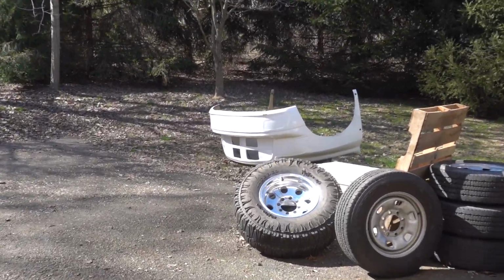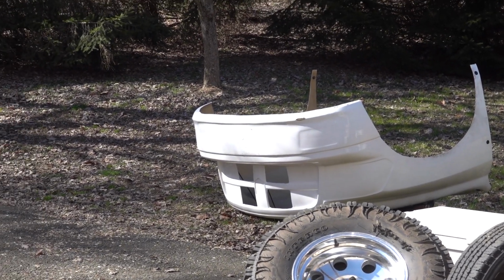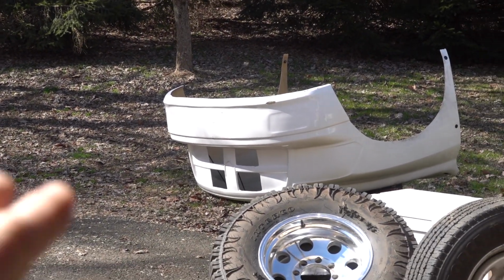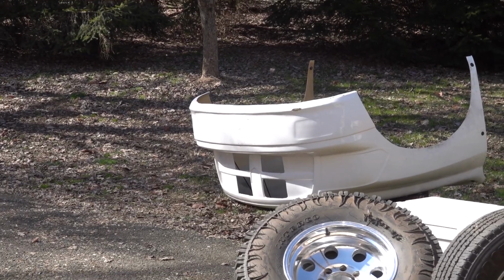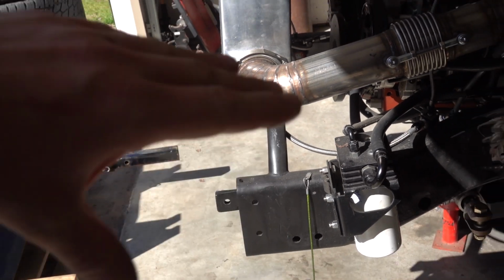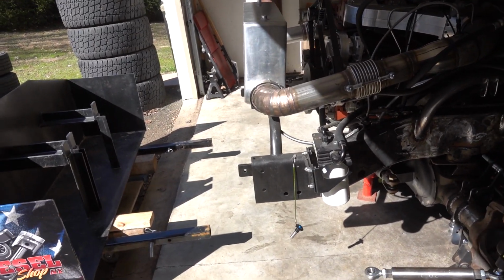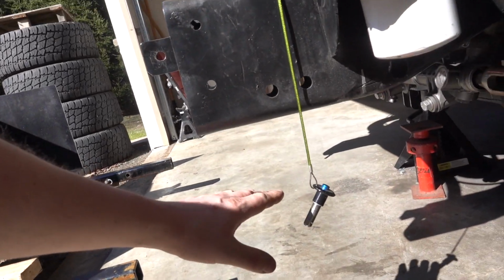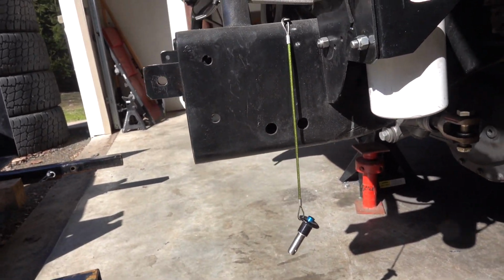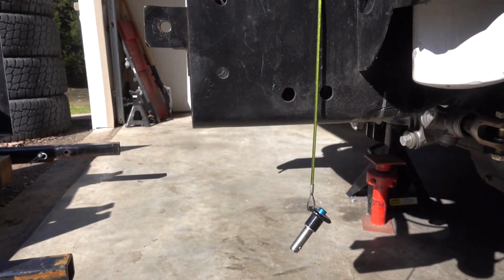Our problem is, obviously, our bumper is attached. And to unattach it, we'd have to come up with a whole new way to mount everything and all that, because our mounting point, our pivot point for our flip up front clip is on the bumper. So we're gonna have to make this thing lower. So we're gonna have to get it down to like here. I believe 4 inches is the number that I had come up with when I measured.